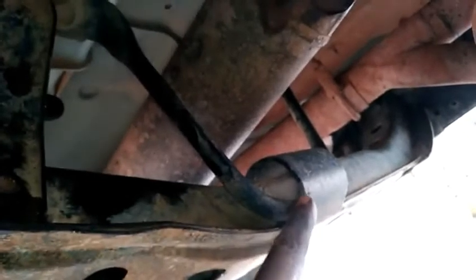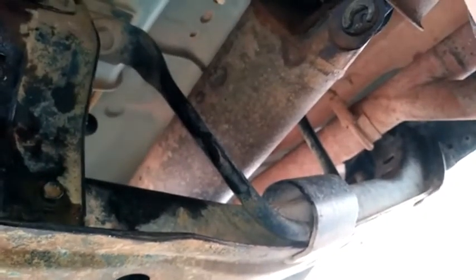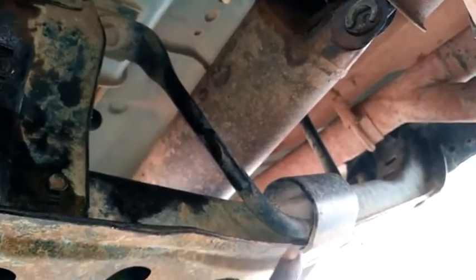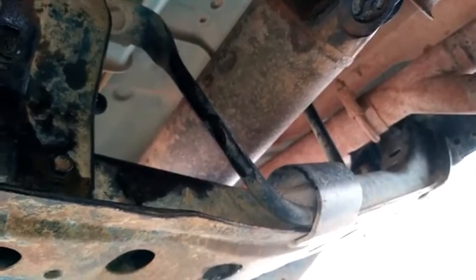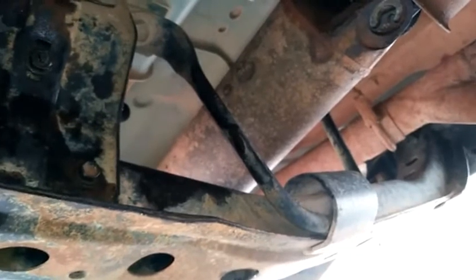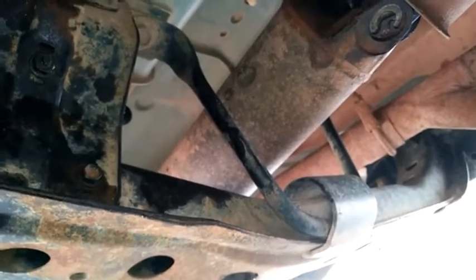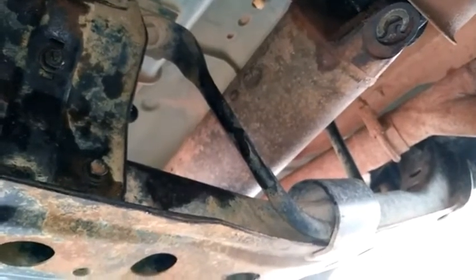While you are under the vehicle, look at this bar that attaches itself to the body — the cab — and this is the chassis. You'll notice that this bar is sitting on the chassis. When driving you may feel a vibration inside the vehicle; most of the time this is where it comes from, because engine vibration suppressed by the mounts is still transferred through the chassis, through this bar, into the cab. This will require replacement of the body cab mount to the chassis, and this bar should sit in the center of its placement.